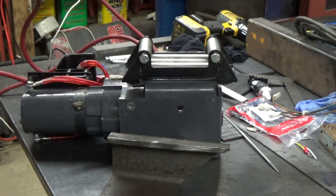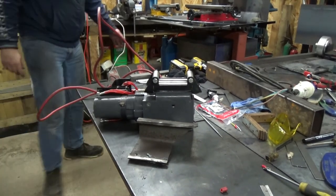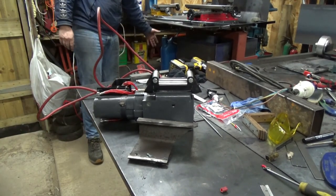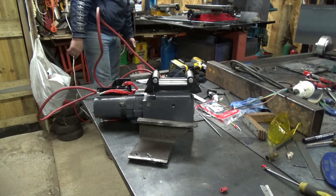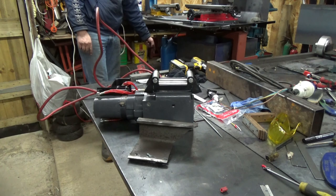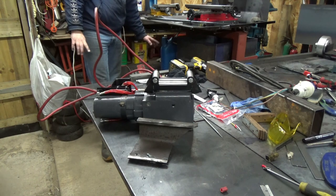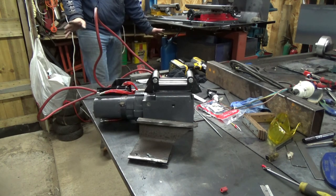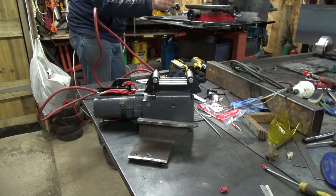At that point, let's say it's at the back of the workshop, let's just bring out a wider angle, let's say that's anchored down here somewhere, right where the bench is. And there's a car outside the front there, and it's dead, and I want to bring it in. Now, instead of pushing it, I could anchor the winch down there at the floor in an anchor bolt, put into the floor just there, and then tuck the car in here. Vice versa, I could have a couple of stainless steel fixings out on the driveway for pulling cars around the driveway as well, or anything else around the driveway for that matter, but people understand cars. The first use for this is for pulling the big machines around.